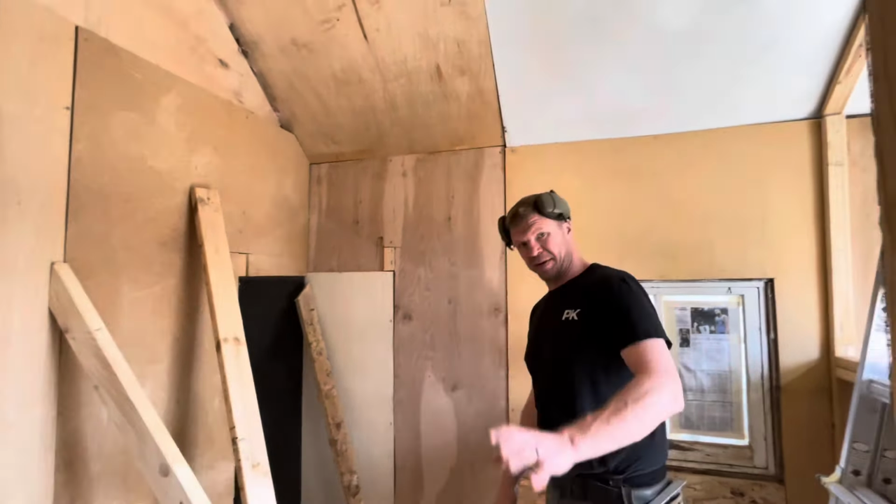So I made a frame for the window earlier. I got boards with a 45 degree angle on them already. So as you can see, that's gonna match up the bottom. I will cut this square and we will have good support. I'm gonna cut one, see how it works out. Guess and check method. It's scientific, I'm telling you. That's gonna have to be just a little bit lower.